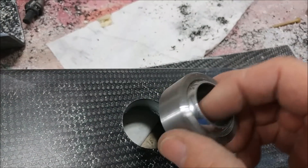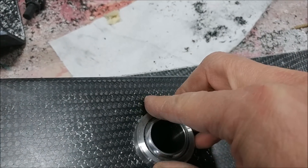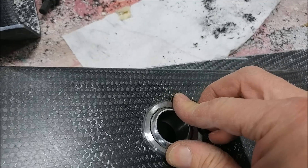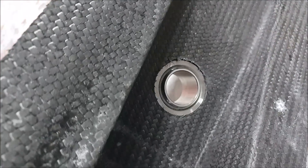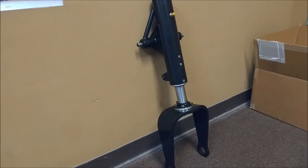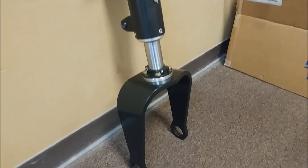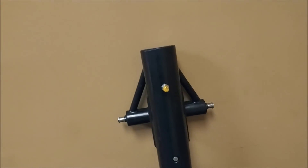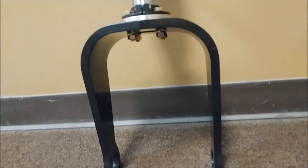Segueing here — this is one of the brackets for the gear. We drilled a hole with the hole saw and there's the bushing that will hold the upper gear mount pivot point. It fits nicely. We're making progress on those brackets because they're key to being able to start bonding all the parts of the fuselage together. Here you can see I've temporarily bolted the fork onto the nose gear leg — that's looking super nice. The black satin powder coat finish we got on there really looks sharp.